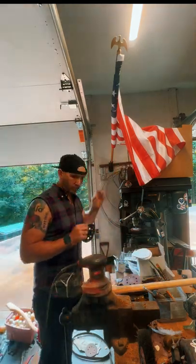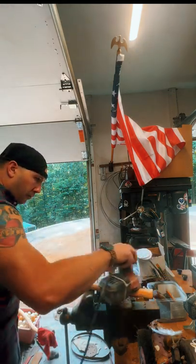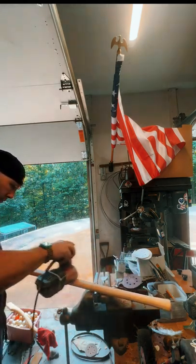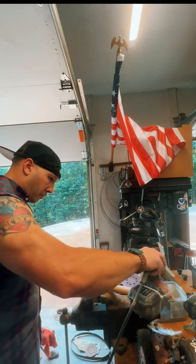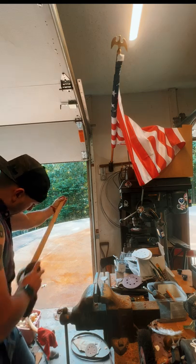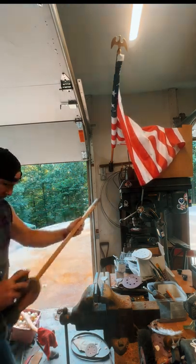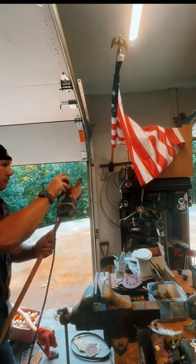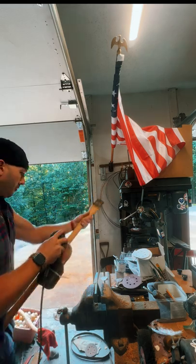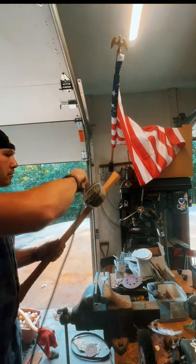Once the lacquer was gone, I went to the sander. I used a 60 grit hand sanding pad to clean it up a little bit before I went to a 320 grit. And I kind of tried to make this an octagon shape. It's not super strong, but you can feel it in the hand for sure. Generally, you would use a rasp if you want to make a solid octagonal handle. Sorry for my stuttering there. But still, I just kind of focused on the lines, and it turned out kind of cool.